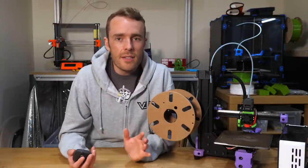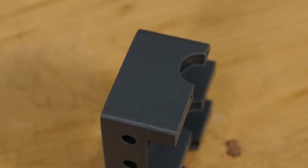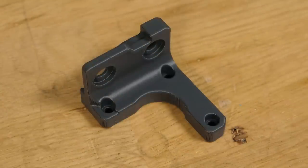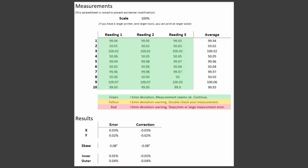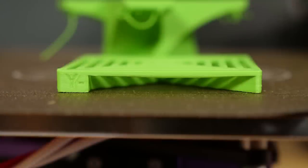Print quality is fantastic. Klipper's input shaping, combined with the included SuperSlicer profiles from RatRig, makes for a very quick way to get great prints. My calibration flower test was particularly impressive, giving great skew results prior to adding any compensation at all. EVA 3.0 also seems to have an improved cooling duct over 2.4, so overhang and bridging performance has definitely improved since the vCore 3.